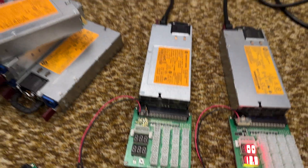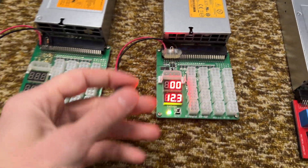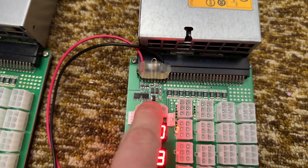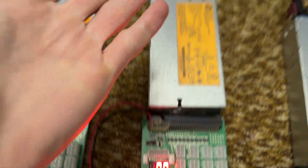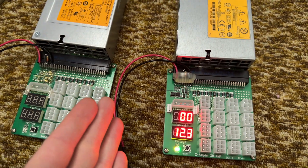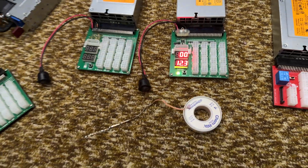All you really need is a solder station. If you want to use a switch and you're having an issue with it staying on like this one, you may want solder wick — it's used to help suck up the solder around these components and push them off. Or you put a bunch of solder on there to heat it up and push it off. If you're not experienced with that, I honestly wouldn't recommend it — you'll probably get solder everywhere. But if you have light experience, it's pretty straightforward.